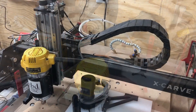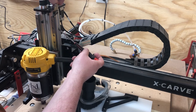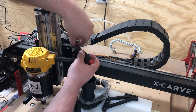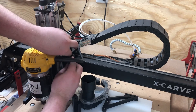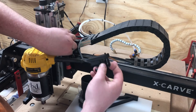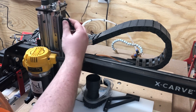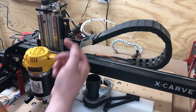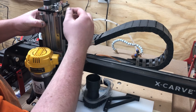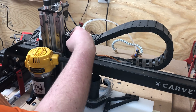Go ahead and put it about there. Now we're going to do the right side — it's a little bit more tricky. I'm going to use my Allen tool, three millimeter again. I'm going to drop the T-nut in from the top and use the Allen wrench to hold it in place, get it down there. Then take the right side bracket and the last fixture handle, install that, grab the T-nut and thread it on. Get it tight, and on the right side you need it to face up when it's tight, so pull out and rotate that to the up position. When you have it down it will slide; when you have it up it won't.